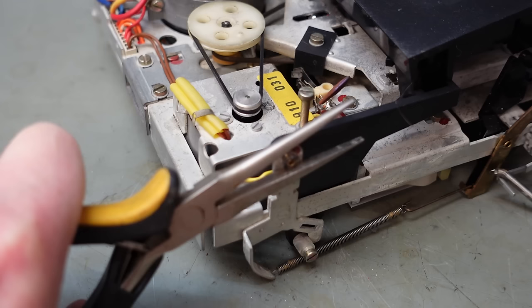Right, next, connect the oscilloscope across the motor. No chassis potential on the oscilloscope. So to stop it from blowing up, I either need to disconnect the ground off that scope I've already got it connected to, or use an isolated scope if I've got one. Or, there's another way. The old oscilloscopes don't have many options. You can look at channel 1 or channel 2 or both together. But the digital ones can do maths.